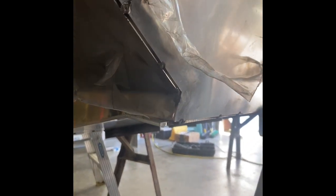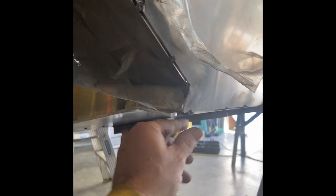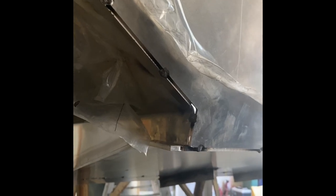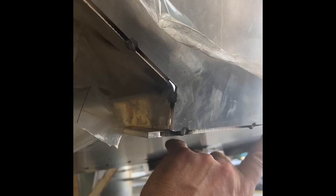This is one tough job as a single-man show — one of those times I wish I had a helper. I just tacked on the right side of the boat, starting at the very aft corner. I made sure it was lined up — these are all edge-to-edge joints on the bottom as well as the transom, so you've got to make sure those things are absolutely perfect. You start in the aft corner, make sure it's tight to the bottom plate and tight to the transom, then put a few tacks and work your way forward.